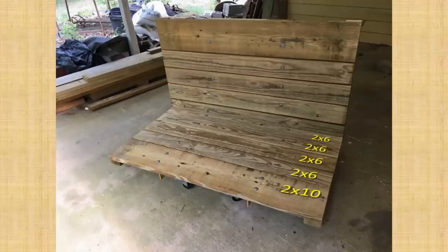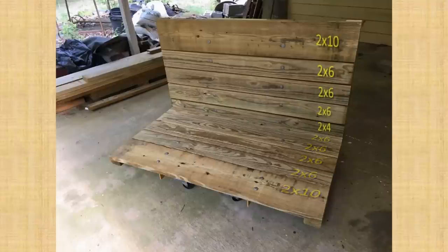The carry-all platform is made up of four 2x6s and one 2x10. Bear in mind, if you get a different frame with different hole spacing, your board sizes and placement will be different. Of course, all of the lumber used should be pressure treated. The backboard is made up of one 2x4 at the bottom, followed by three 2x6s, then one 2x10 at the top.